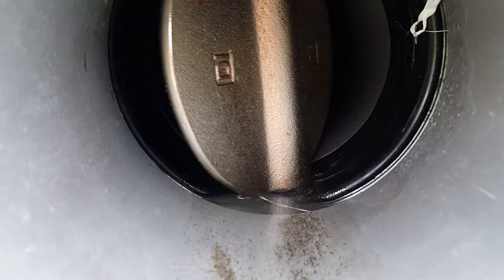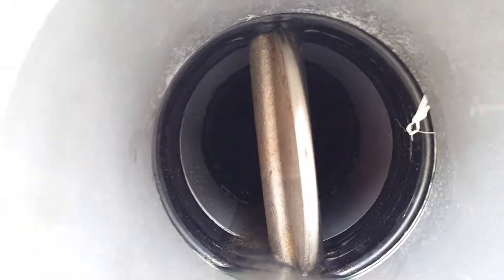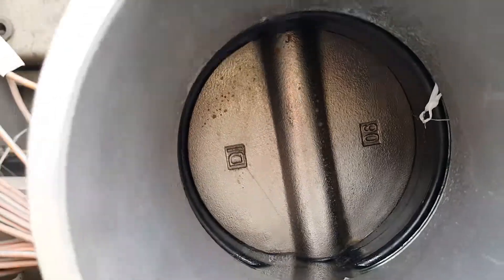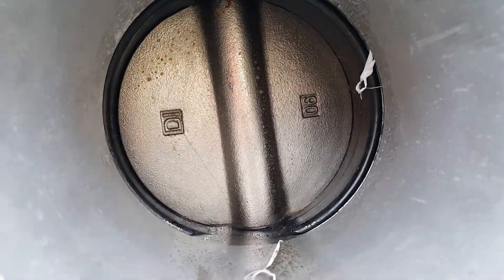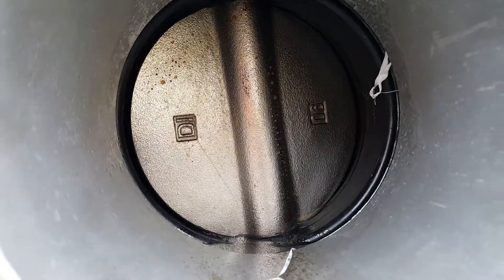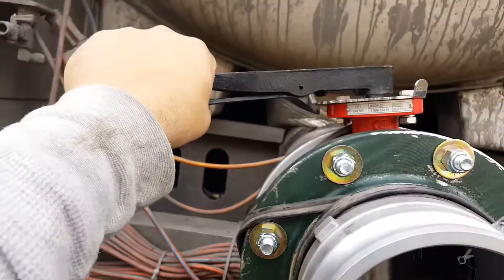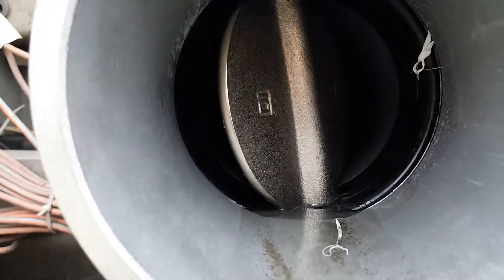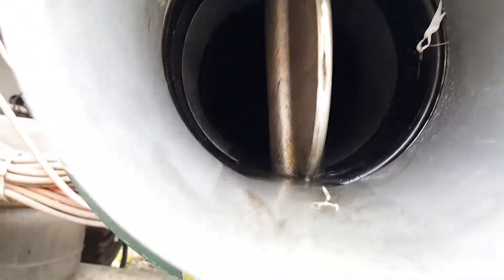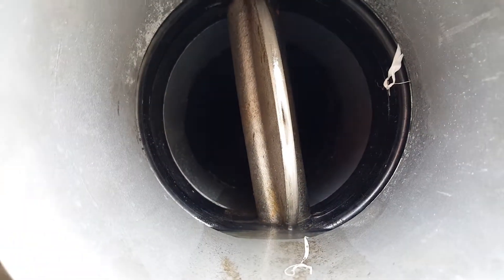Now you can see why they call it a butterfly. It's got a big rubber piece around the edge — it's like a rubbery hard plastic and as you can see it seals really good. Did a lot of maintenance on this tank to make it nice and sealed the whole way around. But you get a rock in it and it'll stop you, but it's not going to chip away the metal or anything. You can only have so much leverage with this one before the resistance. It's definitely better. You got a straight bore the whole way through — you do too on the gate valve, but the gate valve's a piece of shit.